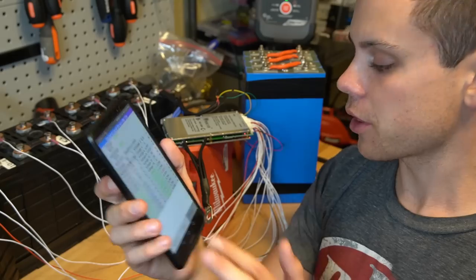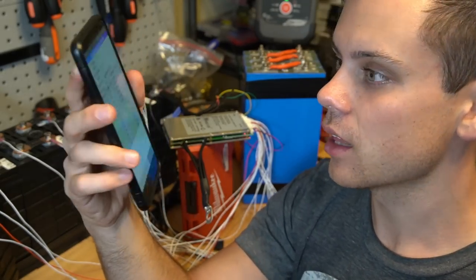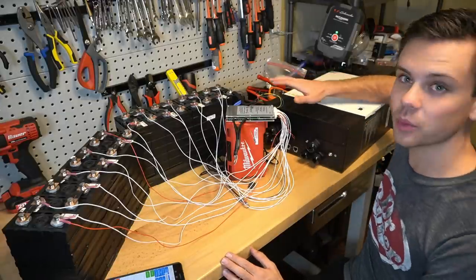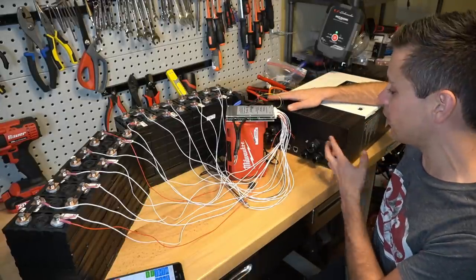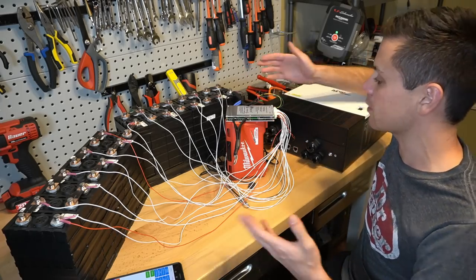You can see every voltage of every individual cell, the temperature, the total battery voltage, and whether the MOSFETs are open or closed. It's not very pretty but it has all the features we need. Now we just need to charge it up and discharge it to see what happens to the cell voltages — it should balance the cells at a higher state of charge. I also want to put the thermometers in a frozen cup of water and see if it will disconnect. We're going to test it with a 48 volt MPP all-in-one unit.